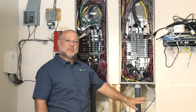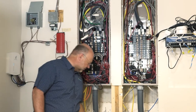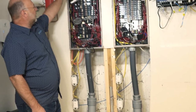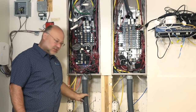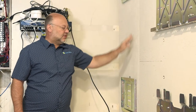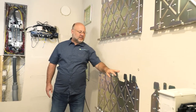We're not going to bring out a sub-panel and do sub-loads for the house. We're going to do a whole-house backup in two service segments. You can see we have two services coming in from the outside in the three-inch hard conduit. We're going to take those service conductors and move them over to an Ensemble switch — I have two switches — and then put 10 kilowatts plus 10 kilowatts of battery into each switch.